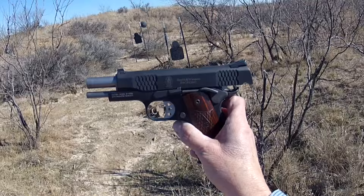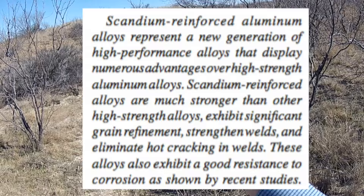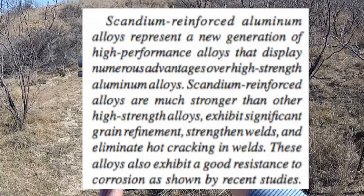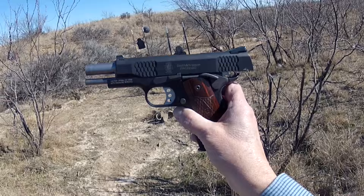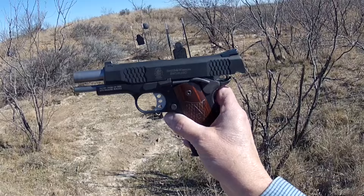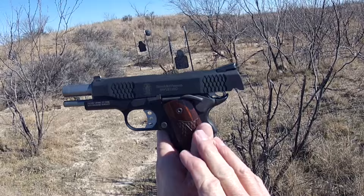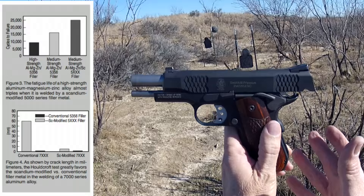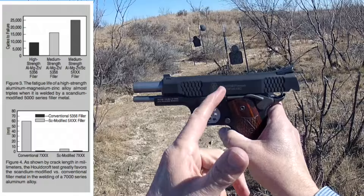Scandium — what does that mean? Scandium is a rare metal. It originally came out of Russia and was mined in Ukraine for many years. Not a lot of it around, so that always equals increased cost, which is one reason this gun is a little more expensive. Now in Australia and New South Wales they're starting to mine it, and the quality is supposedly better since it's a surface mine. Scandium does a lot of good things when you add just a little bit to aluminum: it increases strength, durability, and heat resistance, and makes the aluminum weldable. Aluminum-scandium alloys are becoming popular in the airplane industry, car industry, bicycles, and now guns.